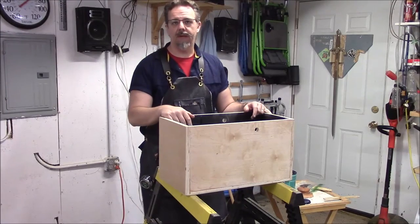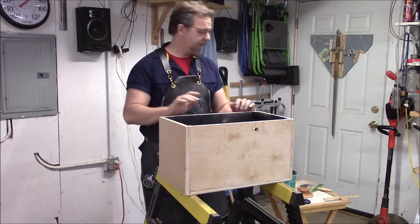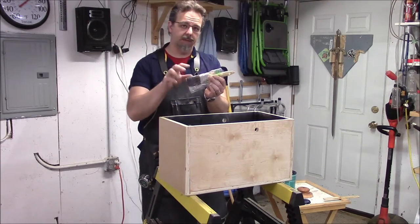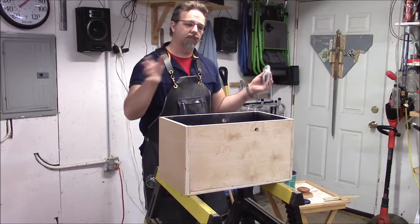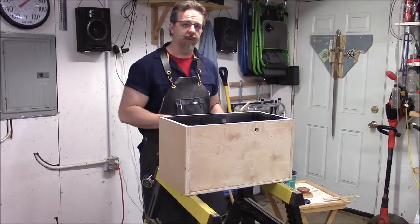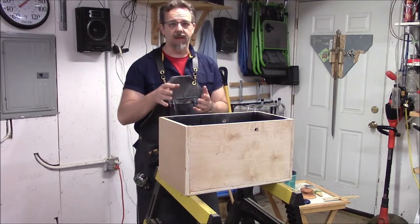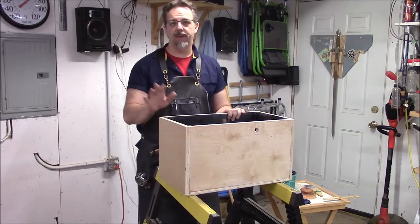I'm about to put a fourth coat of this acrylic polyurethane on. A couple of bonus tips: when you're doing multiple coats per day, you can put your brush into a bag and put it in the fridge — the bag keeps air from getting to it and drying it out, and the fridge also helps prevent it from drying out between coats. But if you're extending coats over a day or two, you've got to clean between each one. Also, when using a water-based finish like this, you do not want to use steel wool to sand it down — steel and water make rust, and you don't want specks of rust in there.